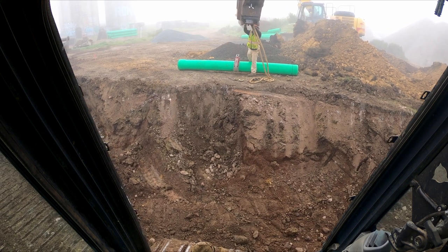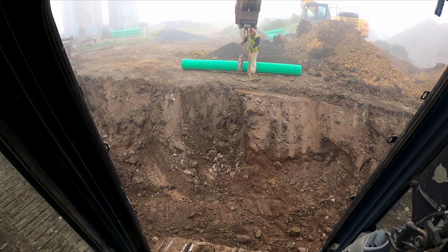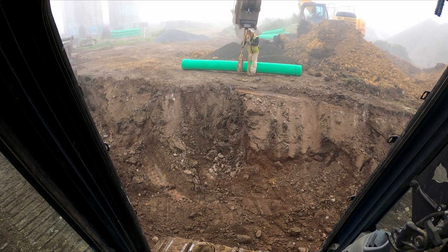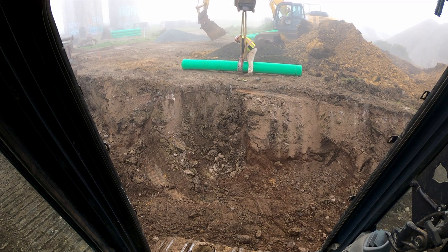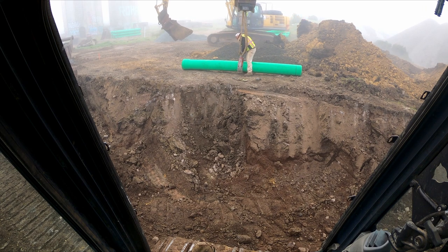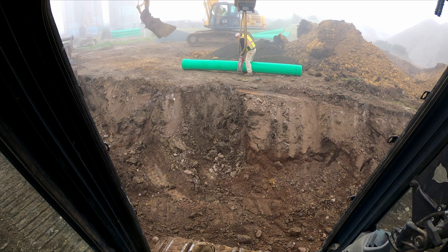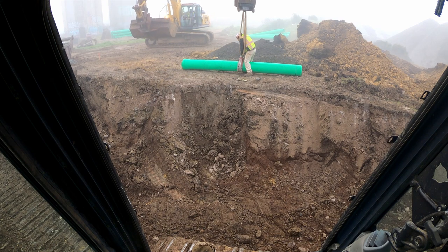Alright, monkeys, this is highly not recommended for straps. The hole that's on here is kind of hard for a shackle because we need either a really large shackle, which usually the pin doesn't fit through the hole because they made the hole too small. It's not a standard D-ring. So what happens is you stick your strap through your D-rings, and they're usually pretty gnarled up from shackles and the weight from other things you're hitting stuff with, and then they tend to cut up your straps. So it's not a good idea to do it that way. You usually want to use a shackle or a hook that's designed for it.